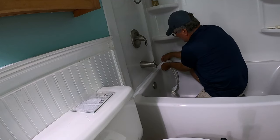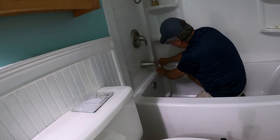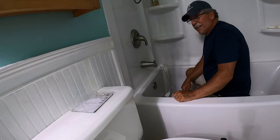Now we've got a corner and a curve — this is going to be tricky. I think I'm going to have to do a relief cut right there. I'm going to put a release cut in there and overlap that a little bit. What I mean by a relief cut is I cut it here and cut it there, and I'll backfill that with just a little bit of regular white caulking. That's the only way you can get around the curves. I've got another curve yet and then I need to put a couple more relief cuts in.